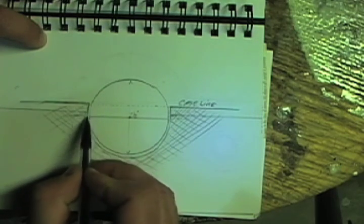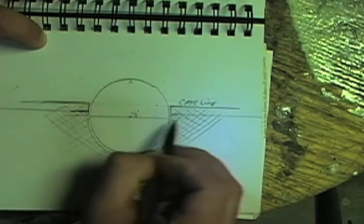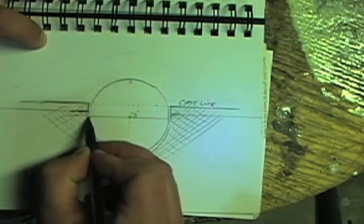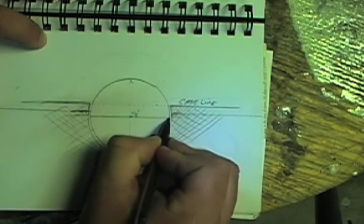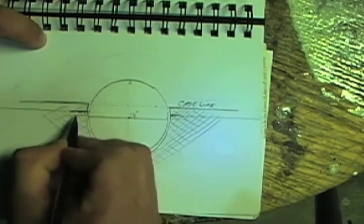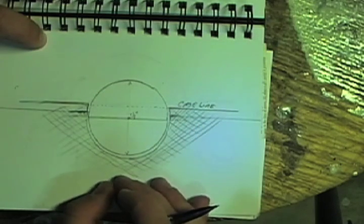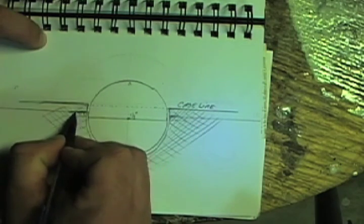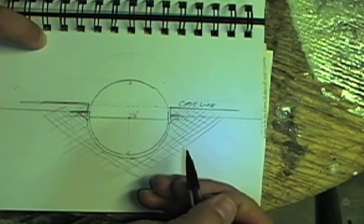So if you look down here, this is a less extreme example, but it essentially gives you the same issue. You're above the equator, and you've locked in. As that ball starts tapering down from its equator, from its widest point, you've now kind of locked it in. You're still going to have a difficult time getting it out of there, and essentially you're going to end up breaking this piece off and causing a huge problem.